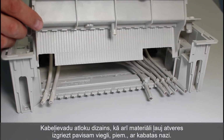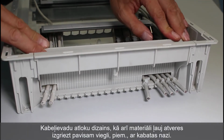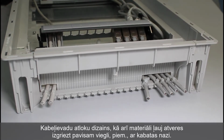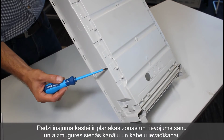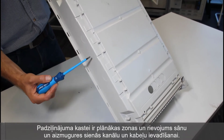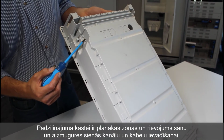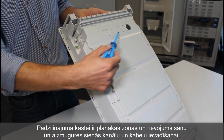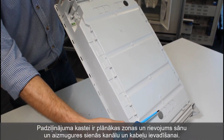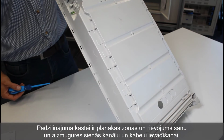The design, as well as the materials used for the cable entry flanges, enable easy cutting of openings, for example with a utility knife. The recess box has thinner areas, and ribbing in the side and rear walls for the introduction of conduits and cables. Up to 10 openings can be made in the rear wall of the flush-mounted box. Their size, number and location is optimized for a typical flush-mounted wiring installation.